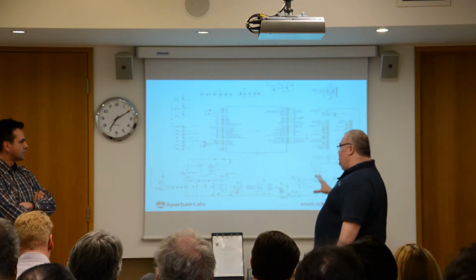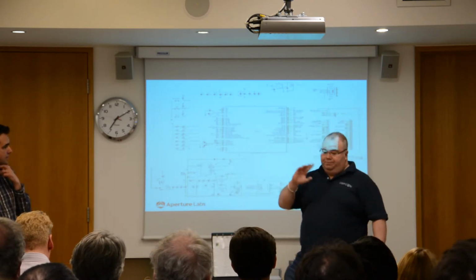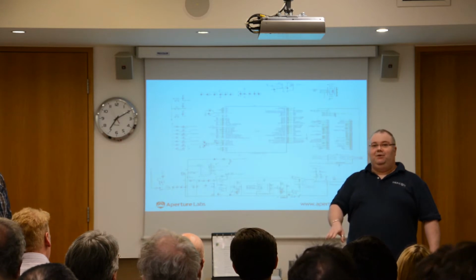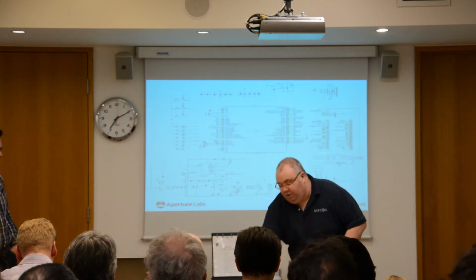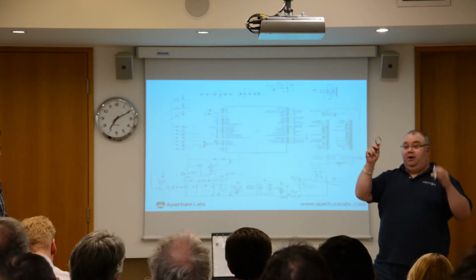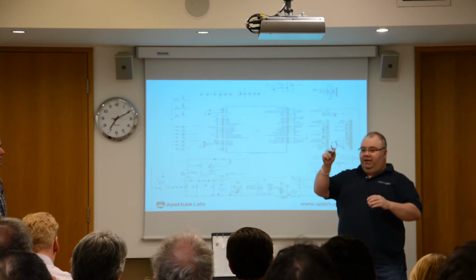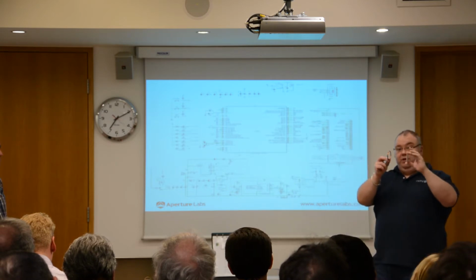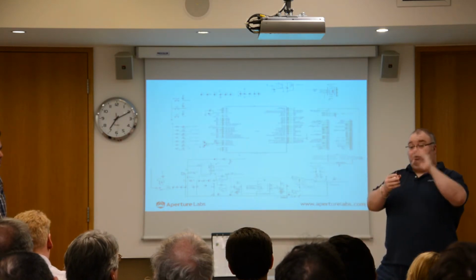And it's really a reasonably simple device. We have a detector here, which is, so hands up, who knows how this type of RFID actually works? Okay, right. So simply, you have two coils, one in the reader and one in the card, and they are resonant circuits. So they normally resonate at about 125 kilohertz. So this has an oscillator attached to it. It's resonating at 125 kilohertz. And this has a resonant circuit, which is a coil and a capacitor tuned to that same resonant frequency. So when you hold them close together, power gets transferred across, and this is what powers your card.